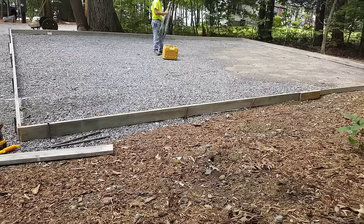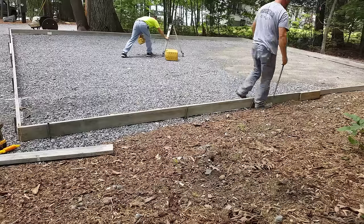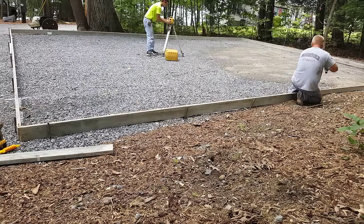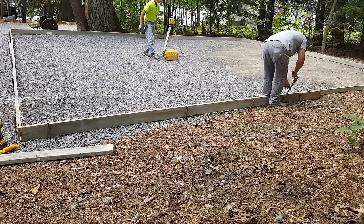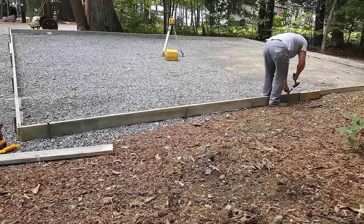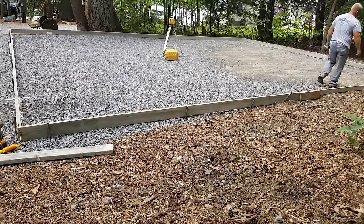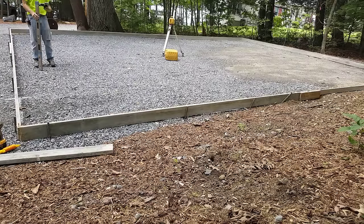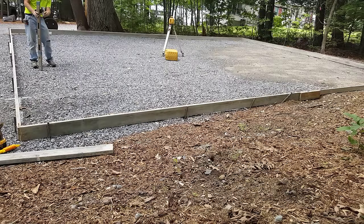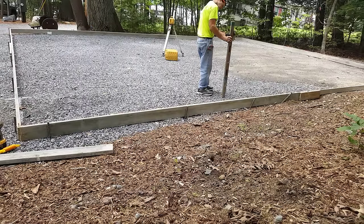Now I'm going to set my laser up — I've got another video for this and I'll have a link up so you can check out how to use a laser level, plus a link in the description for the laser level I like. What I usually do is set the laser up, check my subgrade to see how level it is, get an average of that level, and then have my finished slab grade up six inches from that. I'll have a video about that in the description. Check out the course too — I'd highly recommend taking it if you're getting ready to install a concrete slab.